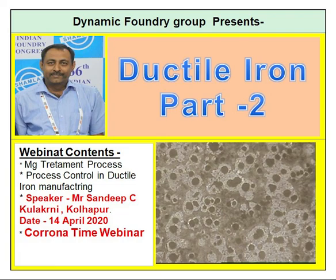Tensile strength: everybody will know that in manganese we have to control 0.2 to get 400/15 grade necessary properties. Strict control on scrap selection is required there to get a ferritic structure. For higher grades, stress relieving is recommended for casting specification as well. Nodularity: final sulfur should not be more than 0.02. Residual magnesium should not be more than 0.04.